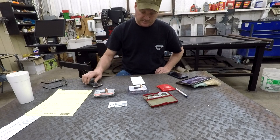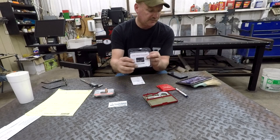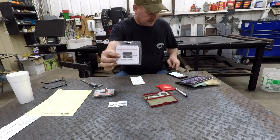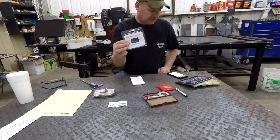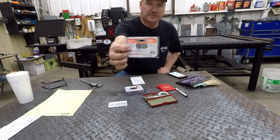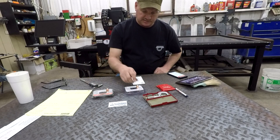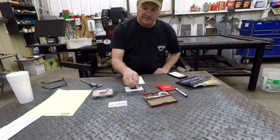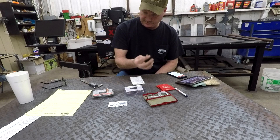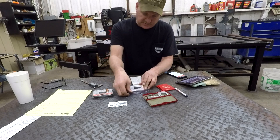I'm not going to go through the motions again — I'll just show you how I checked it. The cheap one here — we're on the 229-41. This is what the package looked like from eBay; the seller was called Minnesota Parts on eBay. And your normal five-pack from Hypertherm, 229-41. I just took some outside measures and I took the inside of the hole. They look identical — absolutely identical. The finish is the same, if not better, on the aftermarket.